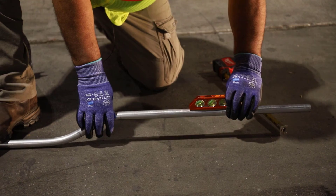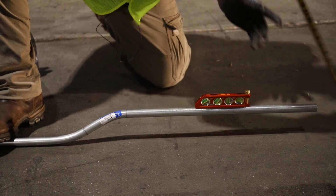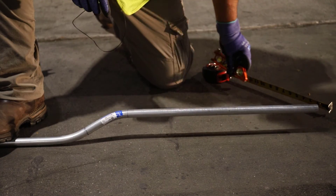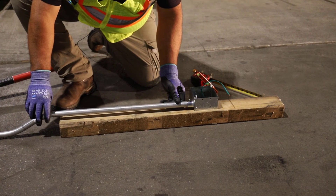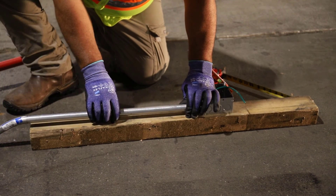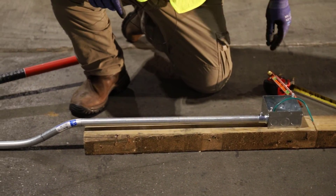We check the level — getting closer. Push a little bit more and it's pretty close. We're looking for two and a half inches of rise, and we've got it. We're leveled. Our whole goal was for this to slide right into that connector, raise off this plane onto this plane, and fit in line with our first mark. And we're perfect.